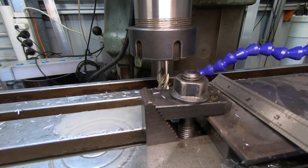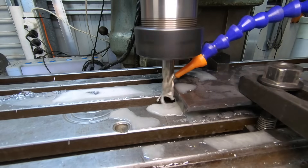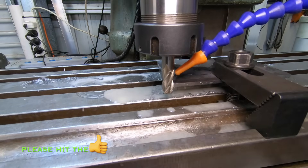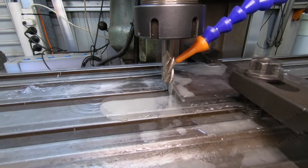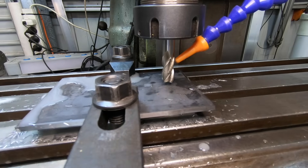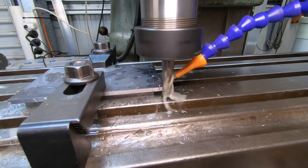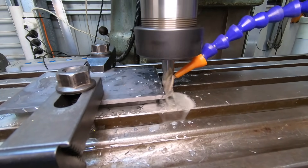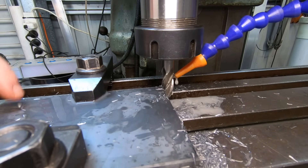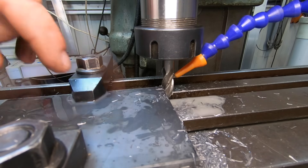It's close enough to three and three-quarters. I've got to swap some clamps around now and hold it from here and here and then sweep the ends. That went well — I've got to move up six and a quarter taking in that cutter, which will give me five and three-quarter inch plate. I'll take all this off, clean up the table, tram the vice back in, set this up on some parallels and then do the sequence of holes.